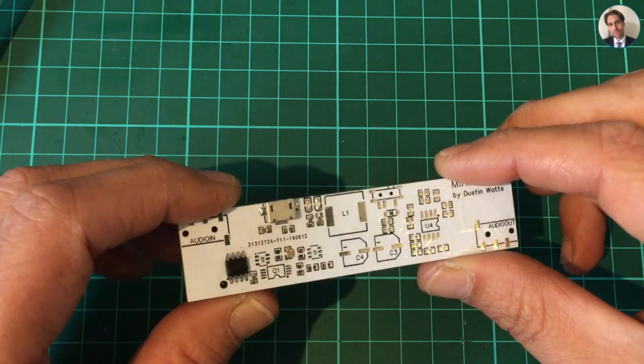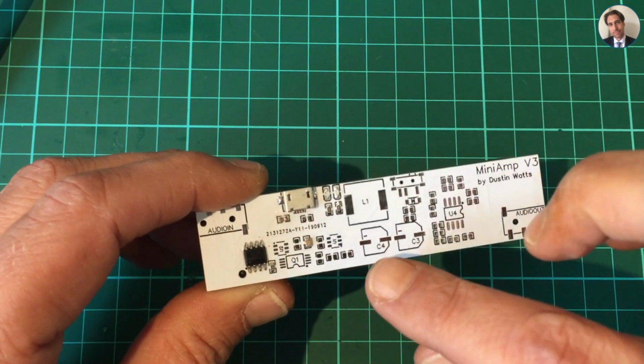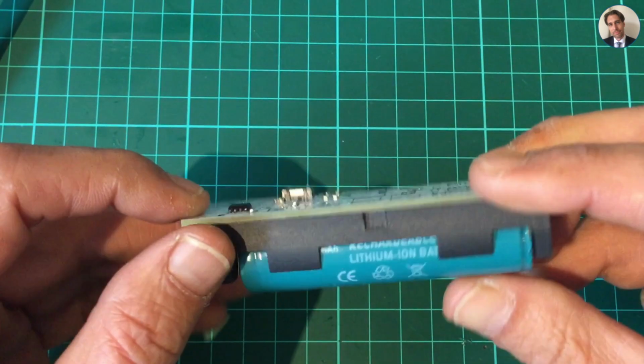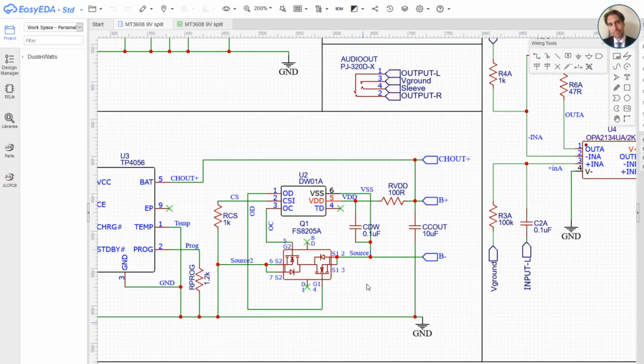So I know what I've done wrong. Me thinking bypassing the protection circuit on the board and just using a protected cell would work. I'm forgetting, when I look at the schematic, that the battery negative is not directly connected to ground. Instead it goes to a dual MOSFET, which is controlled by an over-discharge and an overcharge chip. So these two MOSFETs are currently off, or in their non-conductive state. So the battery negative doesn't make a direct connection to ground. That means I can't charge it.